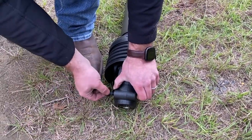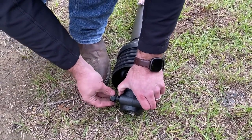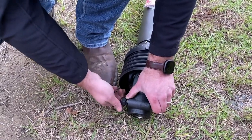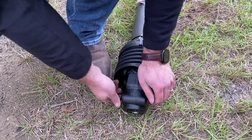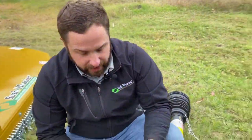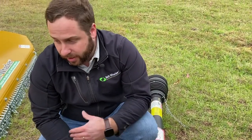Make sure you've got your washer, then put your nut back on. One important thing is to tighten this only about hand tight — you don't need any kind of impact on it. If you use an impact and make it too tight, it weakens the bolt. If you were to get into a rust spot, it could snap that bolt and cause all kinds of problems.